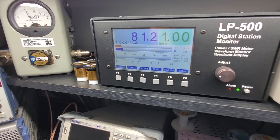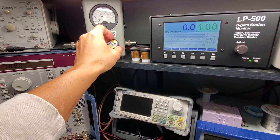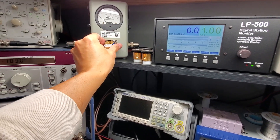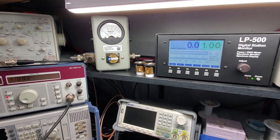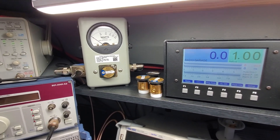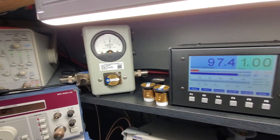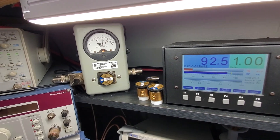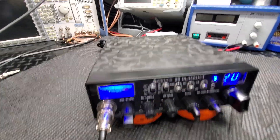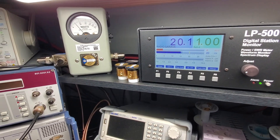Let's see what she's doing for power — radio check, audio. It's just under 100. Showing 30 average. Let's pull this out and put it on the 250-watt slug so we can see peak on the Bird. It's going to be right under that 10-watt mark — that's your modulation. She's got nice loud modulation. Just under 10 on the Bird, just under 100 on the LP — and she's only doing 20 watts.